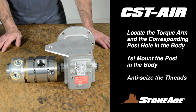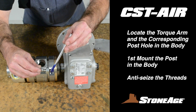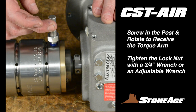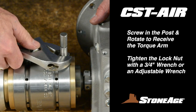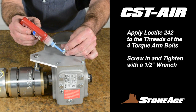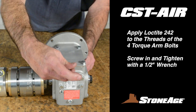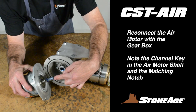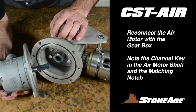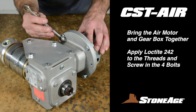Lay the tool on its side in preparation for mounting the torque arm. Before mounting, screw in the post that connects the body with the torque arm. Apply blue goop to the threads of the post and screw it into the body port. The post has its own lock nut — when the post is in place, tighten the lock nut with a 3/4-inch wrench. Position the torque arm so it matches the four holes in the gearbox and at the same time make sure the post engages the hole in the torque arm. Apply blue 242 Loctite to the threads and tighten the four bolts with a half-inch wrench. Now you can connect the air motor to the gearbox. Match up the channel key in the shaft with the slot in the gearbox and bring the two components together. Apply blue Loctite to the threads and screw in the four connecting bolts; tighten with a 9/16-inch wrench.